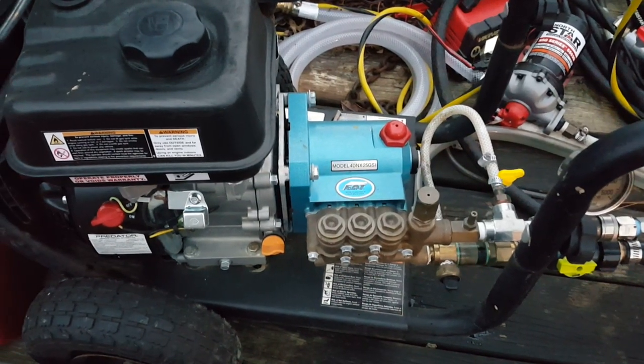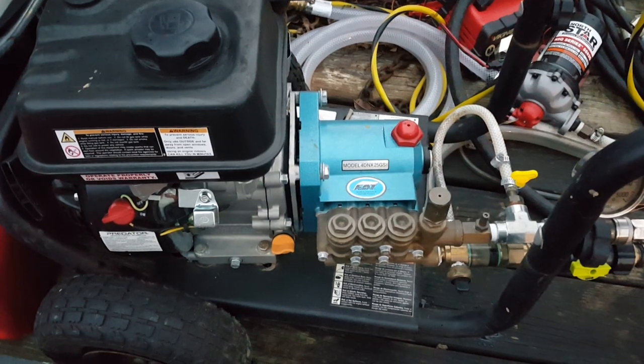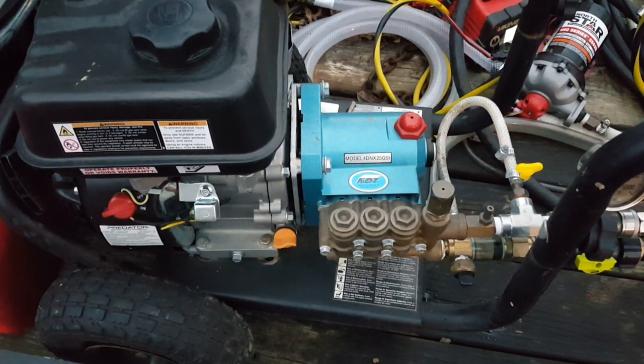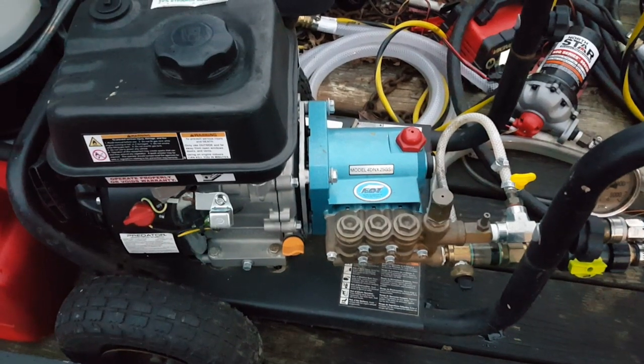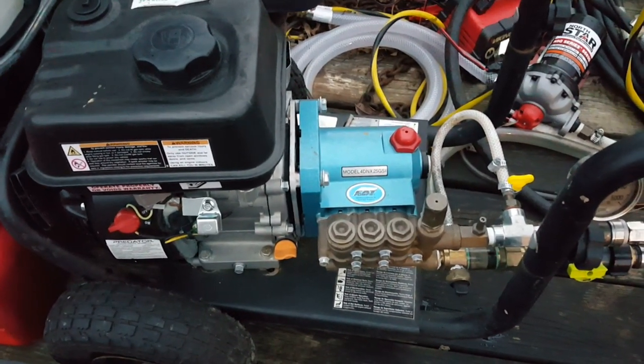electric pressure washer. It's 2 gallons a minute, and now I've got it running through a 100-foot hose, which will drop your pressure, but I've got right at 1,000 psi working pressure, and you know, it's perfect for washing cars. Although there are situations where I do like to use my gas pressure washer.